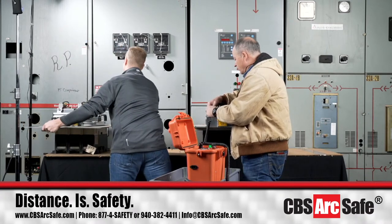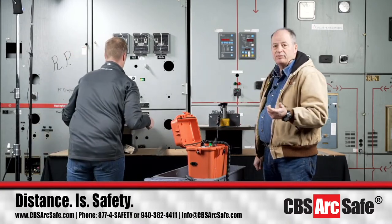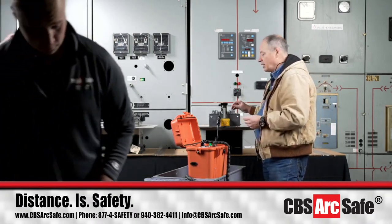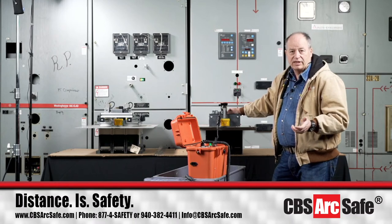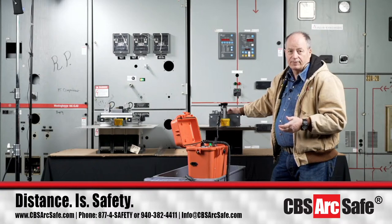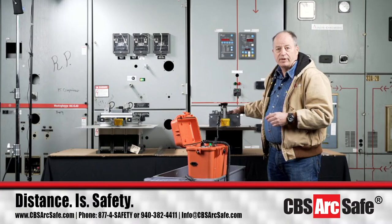So one of the things to understand is we have to do a lot of research on circuit breakers. Just to be honest, when we first started looking at the P frames for Westinghouse, the SPCB frames, we thought that they had just one size, the 2,000, 2,500, or 3,000 amp size. It turns out that these come in three different sizes. The smallest one's in the 800 amp frame, then they have a 1,200 amp frame, and then they use the same physical size circuit breaker for the 2,000, 2,500, and 3,000 amp breakers. So we need to see face measurements again of what size circuit breaker you have and whether or not you might have the shunt trip on this thing also.